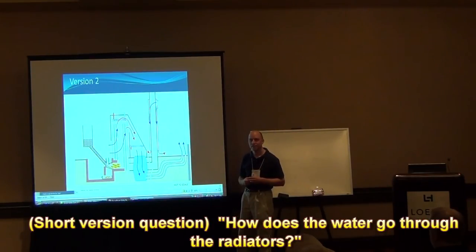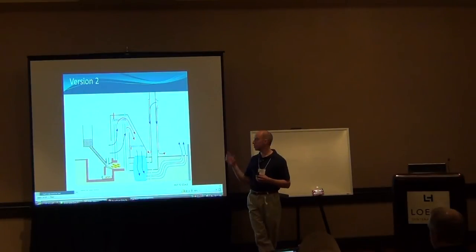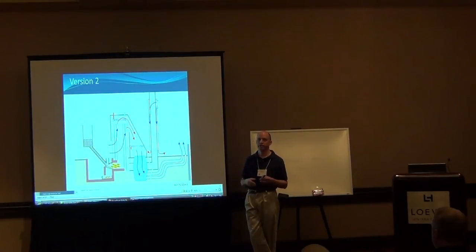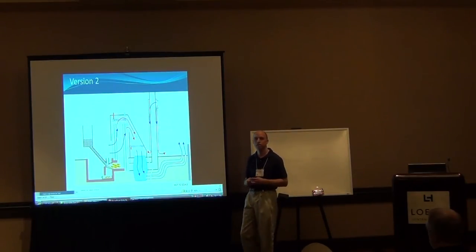Yes? I may have just disturbed you. With the radiator, are you relying on the heat from the mass heater and the coolness of when it cools down running through or under your fish tanks to circulate the water? The water that's going through this is just tied into the pump for the rest of the circulation system for the aquaponics. So it is getting pumped, but I'm just taking a small fraction out of that, so it's not like I'm using any extra electricity for it.